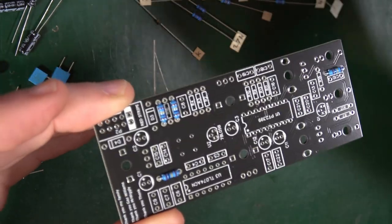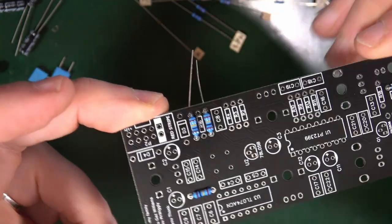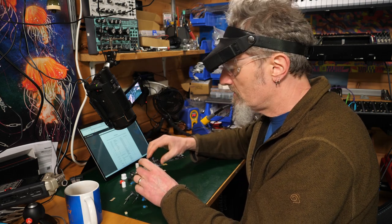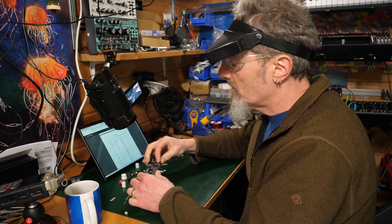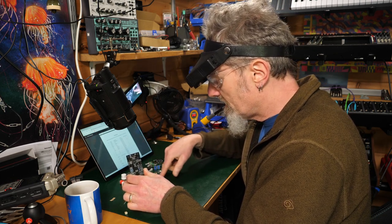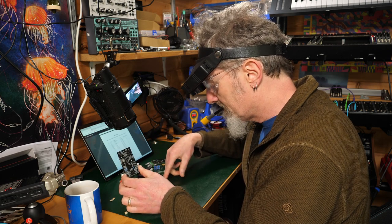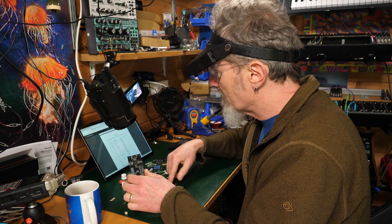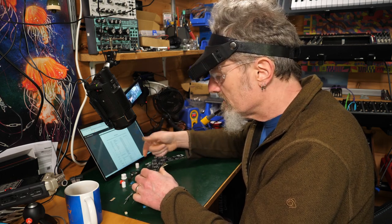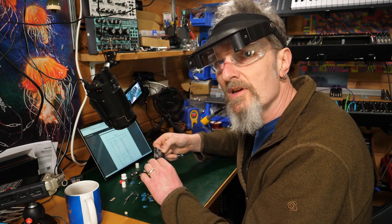So that's the idea. So I'm going to follow this through, put all the resistors on, and then solder them. That's the plan. I'm just going to get on and do that rather than rabbiting on or talking about nonsense. So populate it all, follow the bill of materials. So the next one is going to be 120. I'll be able to find that because they're all brilliantly labeled. He says 120. That one is going to go in R2. So on and so forth. And then you turn it over, solder the whole lot, snip the legs off, and I'll see you at the other end of that.